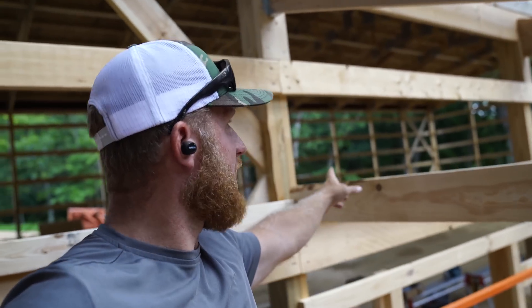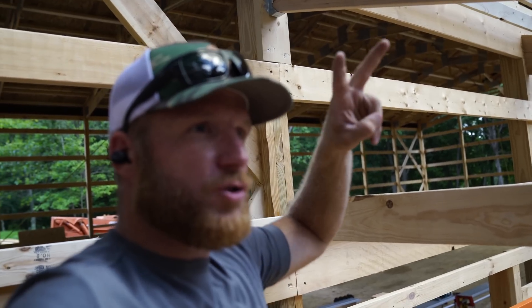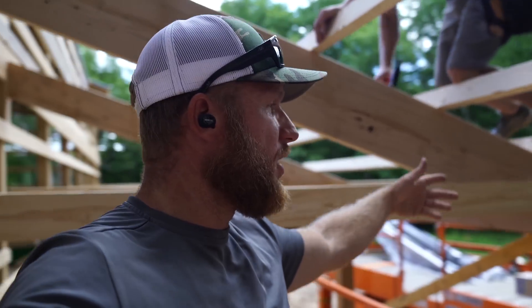Now that we've got these rafters framed in, we can go ahead and do our purlins, the exact same way that we do the purlins up on our trusses. That might be a little confusing to people because we have this six by six cedar header out here — you're thinking maybe why not just do a two by six or two by eight rafter two foot on center. Honestly, it's because I don't want any supporting weight on those six by six beams at all. By not having any weight on them I don't have to worry about them sagging over time. The way our porches are designed, we've got the rafter resting on the post of the post frame as well as the post out here on the porch, so it's always load bearing right to a foundation — no support through the middle, which is the beauty of post frame.